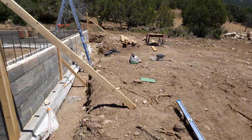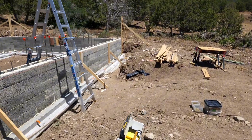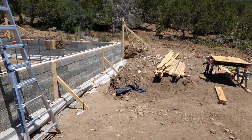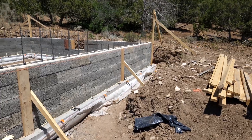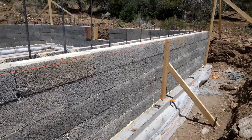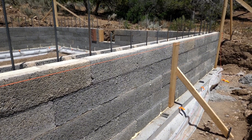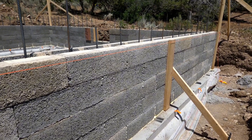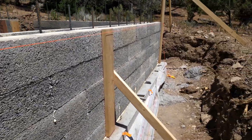In general, the blocks seem to vary a little bit more than you might think — maybe up to a quarter inch. So we had to do a little bit of cutting to fit everything in. But because the house was designed on the increments they recommend, which are odd numbers on lengths, and door openings — I got smaller doors that need a 36-inch rough opening — there was pretty much almost no cutting needed. So everything fits together nicely.